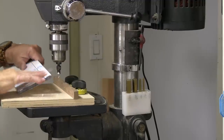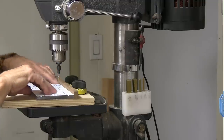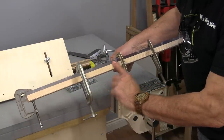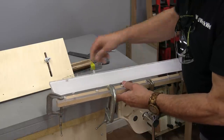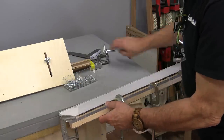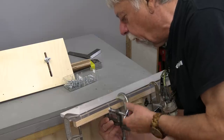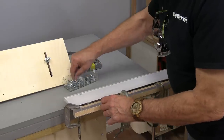Yeah, that's going to be just fine — really nothing much at all, it drills into it very easily. Okay, I've been very careful to make sure that this wood is aligned perfectly with the plastic all the way along here, and there are the screw holes that I drilled. What I need to do now is start putting some screws in, but I don't want this wood to split, so at every place where I need to drive a screw in I'm going to clamp that wood temporarily while I drive the screw in, and that will prevent that wood from cracking. We'll do one and then I'll do the rest of them off-camera.